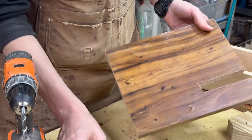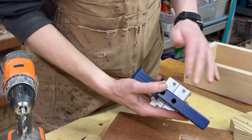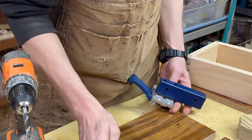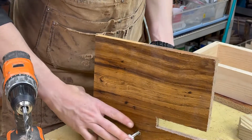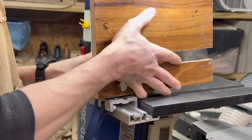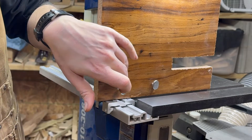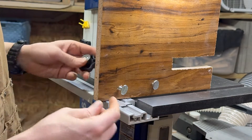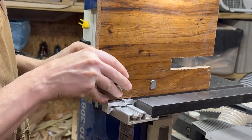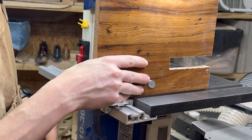We can immediately test-fit this. Since the blade will be over here we're putting the fence on the outside. Do the test before we cut the sunken-in areas for the heads. Then go over to the table, lock down your fence so it's stable, hold this up, and get your two T-bolts on — leave them loose a little bit, then hold the fence down to the table and tighten them. And there is your fence. Now we'll go and chisel out the area for the bolt heads. This is a nice stable fence that's not going anywhere.